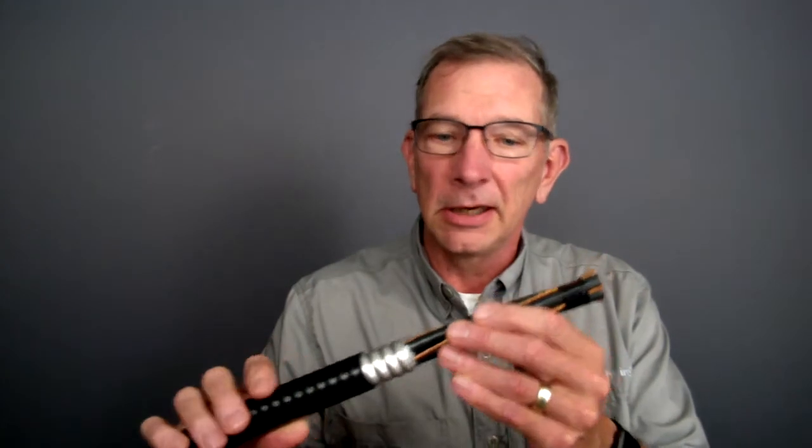This cable, in addition to having three conductors and three grounds symmetrically placed in the interstices of the conductor, has a Continuously Welded Corrugated Aluminum Armor construction. These cables require special cable glands that differ from our glands for Copper Tape Shield VFD cable or Copper Braid Shield VFD cable.